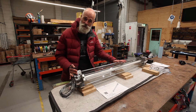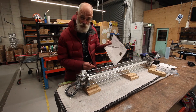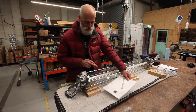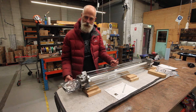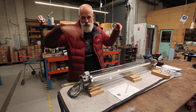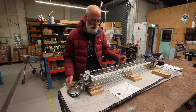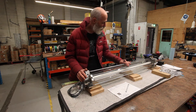So there we have it — finished, bolted in, completed, wired. This comes with an instruction sheet which explains precisely what it is that's gone on here, what the retrofit is, and the type of component that this LED is. We also use this low voltage braided cable, which will go to the ceiling — on the ceiling, in the cavity, in the conduit, wherever it is — where a driver will be located. In this case, not the Triac, but a 1-to-10 volt dimmer. So what we'll do is fire up the finished result to test and show you the dimming.